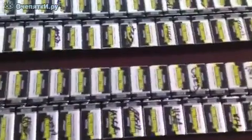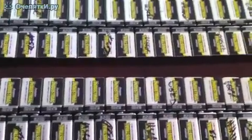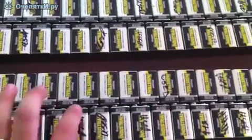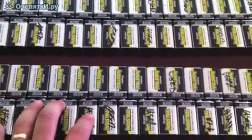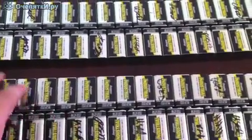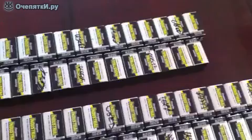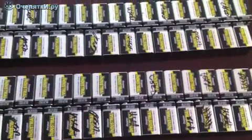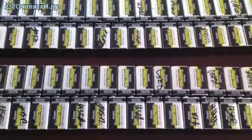So I did a measurement. Now theoretically, this is a lot of volts. I didn't even do the measurement, but it's 244 batteries. These are used batteries. They're not all new. I didn't buy these. I don't have that kind of money or spare time. But I did a voltage reading with my meter in chunks, and it's about 2,000 volts DC. So we're going to hook this up, and we're going to see what kind of arc 2,000 volts DC gives.